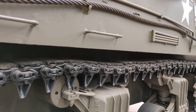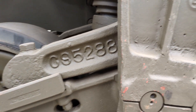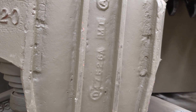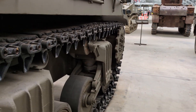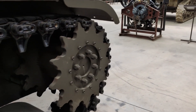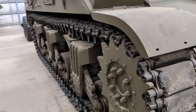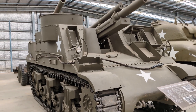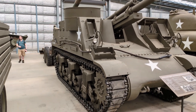The ammunition fired by the 105mm howitzer was mainly the M1 high-explosive round — a 15-kilogram, 740-millimeter-long single piece of ammunition. The cartridge case was semi-attached to the shell so the crew could remove it to adjust the bagged propellant charge inside to produce the desired range, with a maximum range of 11 kilometers. Initially carrying 57 rounds, the vehicle was redesigned to carry up to 69 rounds in early production. Rounds stored vertically along the sides were somewhat vulnerable as they stuck up above the citadel, so folding sides were added early in production to protect them.